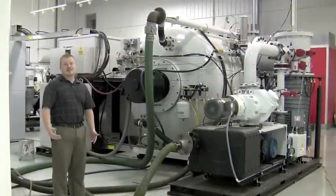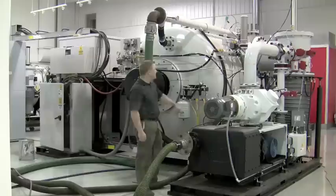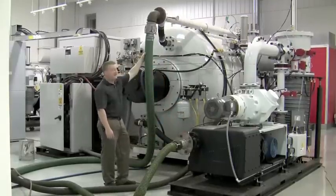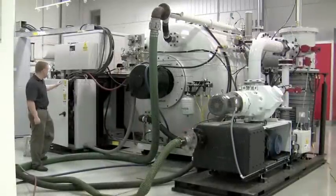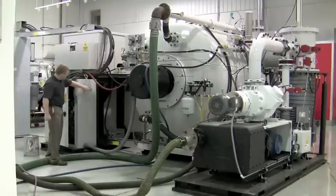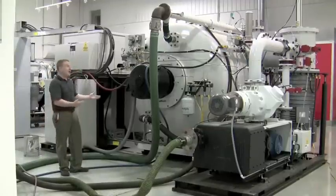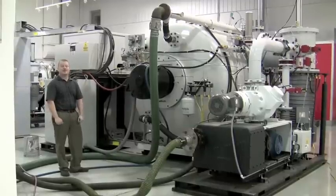This is the rear of the furnace. It has all the utility inlets and outlets, also showing the gas blower for the cooling cycle. This is the nitrogen inlet — it gets plumbed from your accumulator tank from your gas accumulation system. This is the water inlet and drain, which ties into your open or closed loop water system to keep the furnace cool during operation. This is the furnace main disconnect, where the power from your facility comes in and connects to the furnace. Typically customers mount through an LB or through the top with conduit. The back needs enough room for maintenance — for instance, the gas blower is fairly large and bulky, so you need a crane or forklift to remove it.